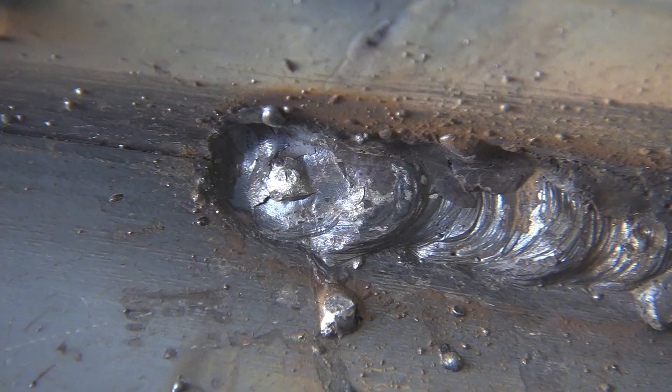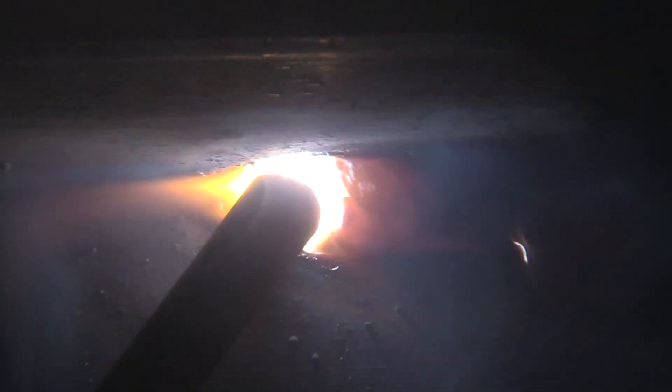So you need a tight arc, not excessive rod angle, and enough amperage so that the rod won't stick when you hold the tight arc. That's just a mess right there — undercut, slag, I had all kinds of BBs hitting near my feet. And all I did differently here was tighten that arc up, and everything's going a whole lot better.